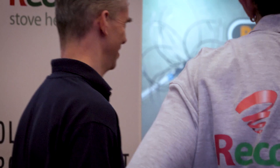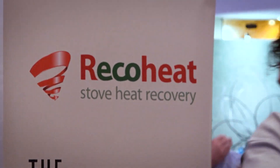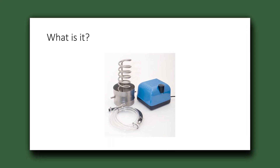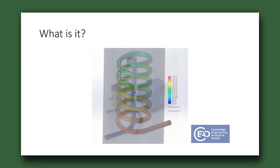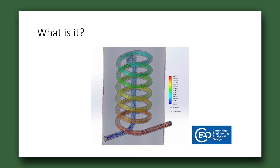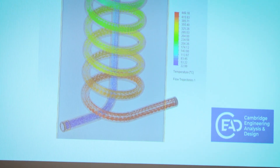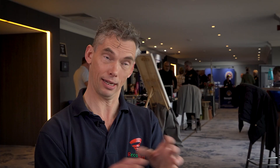It essentially exploits the properties of turbulent air to capture heat very quickly and efficiently from the flue, and circulate that. It uses quite a large electric pump — an aquarium pump — that pumps air in at a litre a second to the back of the coil. Flue gases hit it, heat it, and it expands. As soon as it expands, it accelerates. When it accelerates, it goes turbulent. It just exchanges the heat, and the heat curve goes like that.